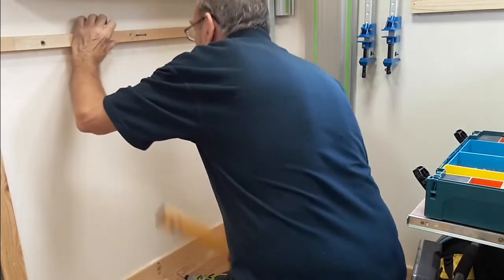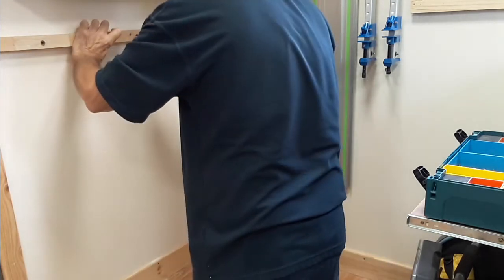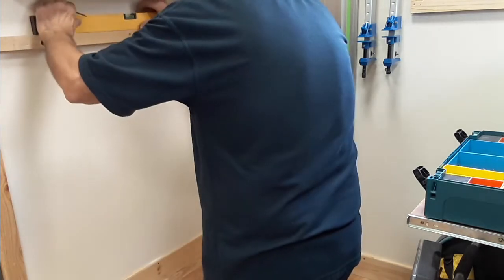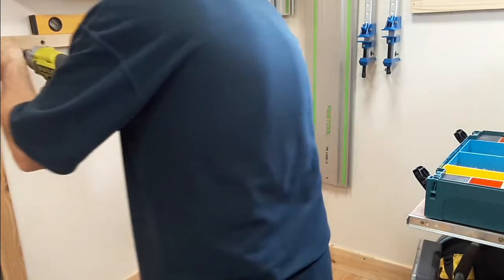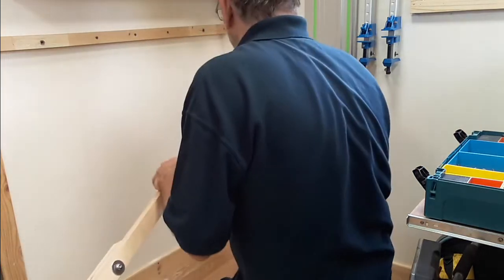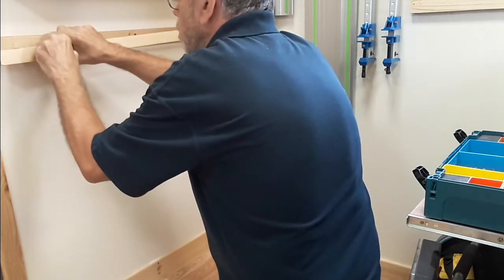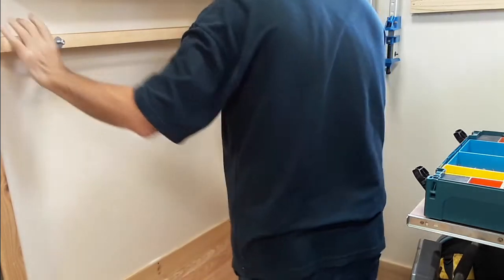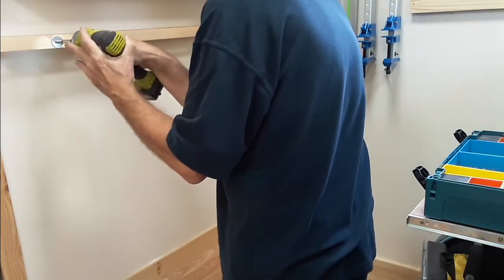In the event I was fortunate with the baton - I moved the height by about 10 millimeters so that it coincided with the cross studs in the panel, which has allowed me to put about five or six screws to fix it to the wall, all with decent fixing straight into the 3x2 studs that lie behind it. So there's a lot more support there than I was originally thinking I might have.